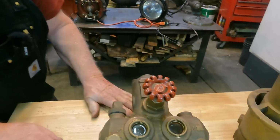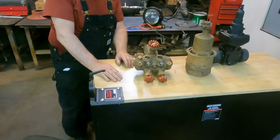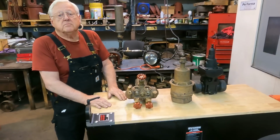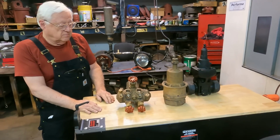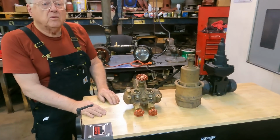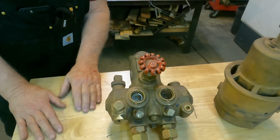Well, basically, on any of these steam appliances you need to have lubrication in them. So the way they do that, rather than having dripping oil, you actually inject the oil into the steam itself. And that will lubricate the cylinder and piston, or pretty much anything you have out here. So all your steam appliances or anything on the engine is going to have oil put in it. And this was basically how they put the oil into the steam, in very simplified layman's terms.